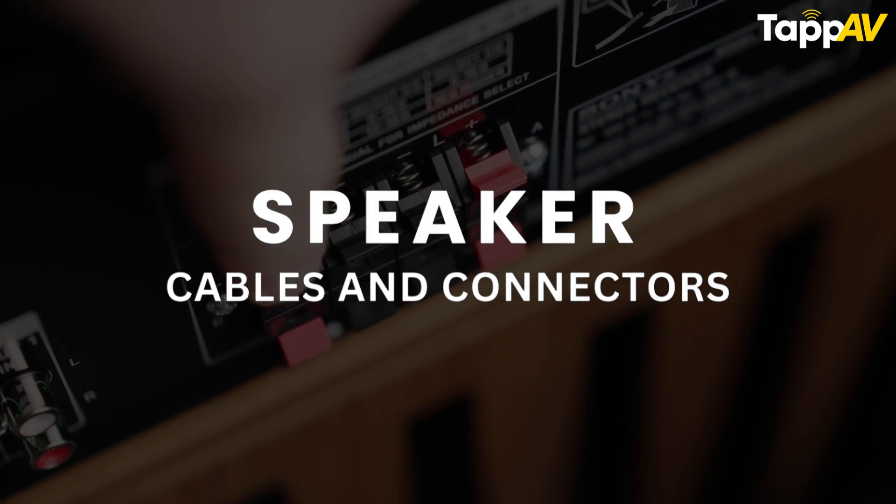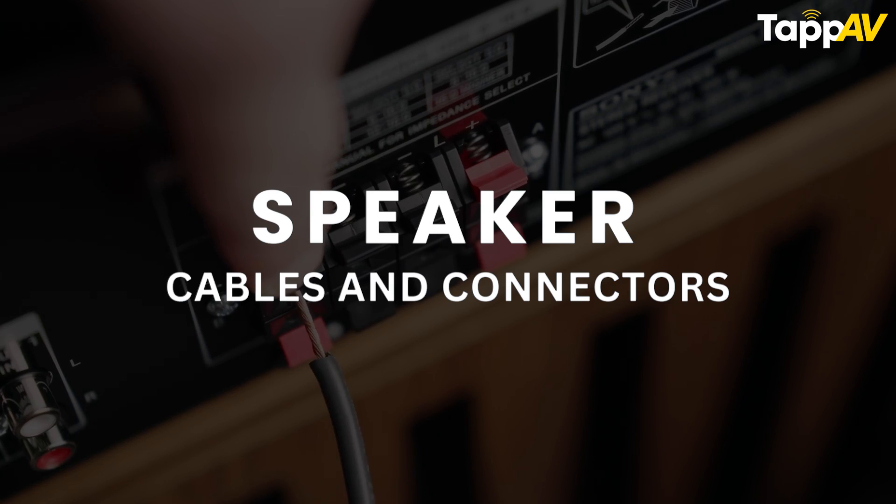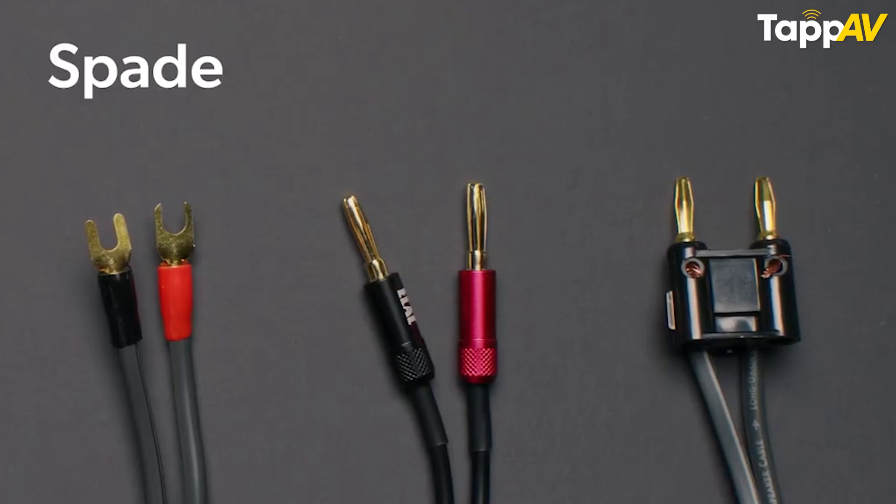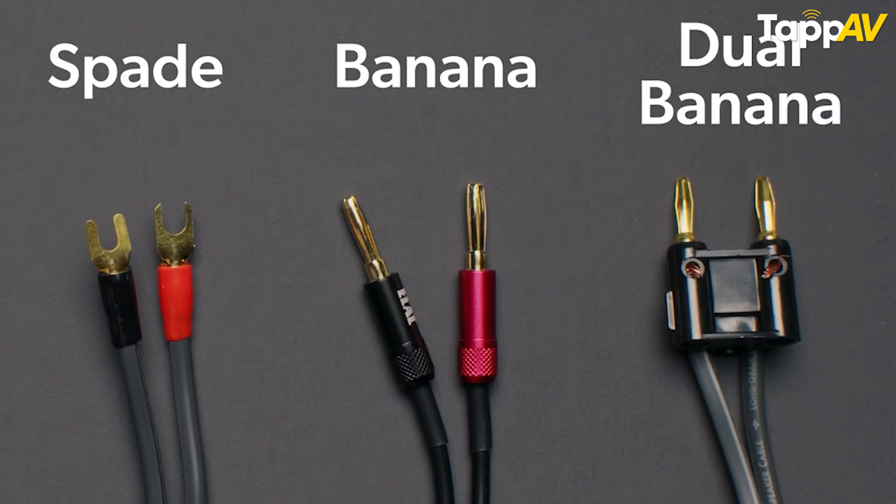The fourth and most important tip is that when you do your amplifier and speaker connection, it has to happen through speaker cables, so don't overlook them. They have to be of high quality, oxygen-free copper. The gauge of the speaker cable needs to match your cable distance as well as the power requirement of the speaker — 12 gauge, 14 gauge, or 16 gauge. Please check which is required for your speaker. For connections, always use banana plugs or spade connectors so that there is a smooth transition of sound without any losses at the connector end.